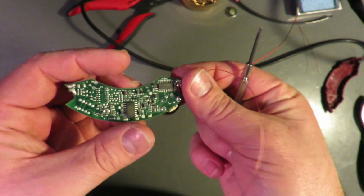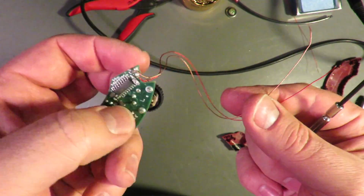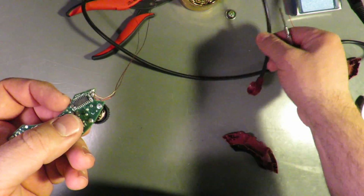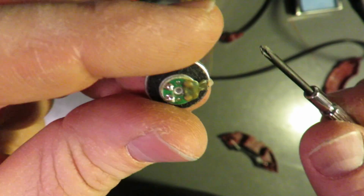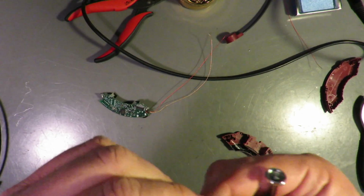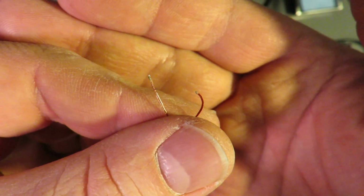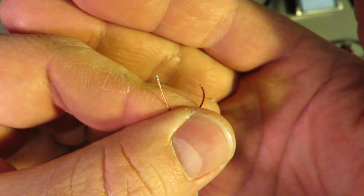I would say if you're taking these apart, the most important thing is to be very gentle with, not this end, but yanking them through these hollow earpiece tubes. Because they come unsoldered from these guys very easily. I don't know that they're actually becoming unsoldered. I think if you look at the ends of these cables, they're probably breaking off. Looks like these still have a little bit of tin on them, so.